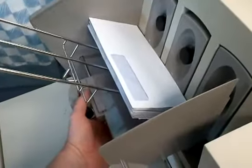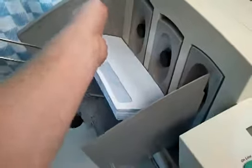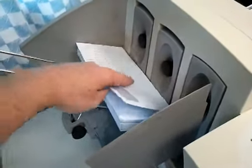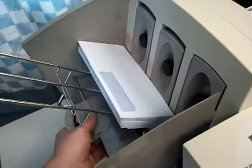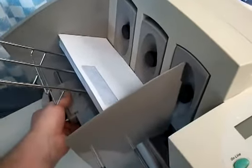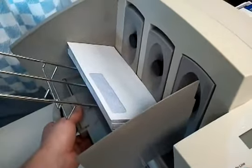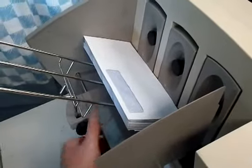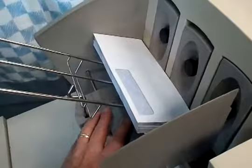This is under my elevator again. Now if we find that the envelopes are tilted or twisted on one side and going through crooked, I could offset the elevator to one side or the other to try to keep it from skewing. Most of that job should be done by the side guide.